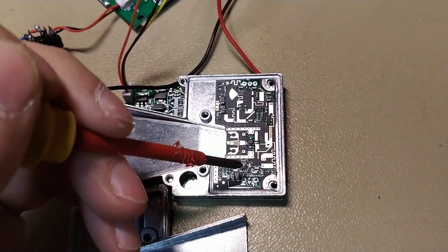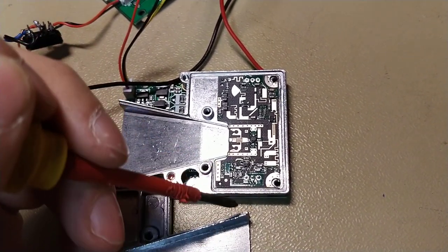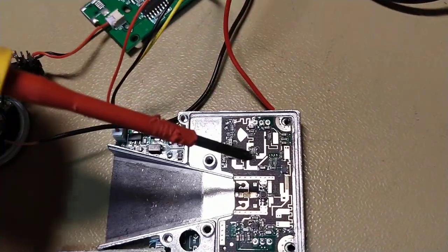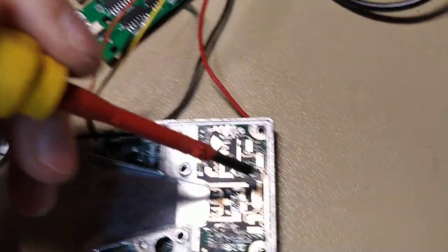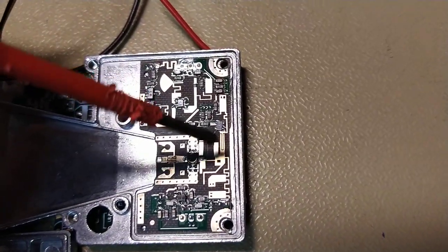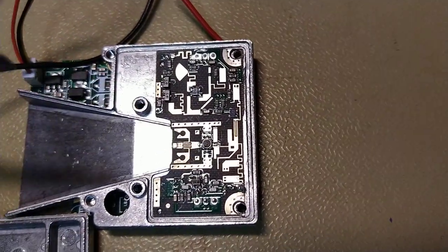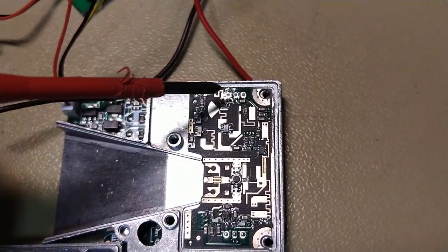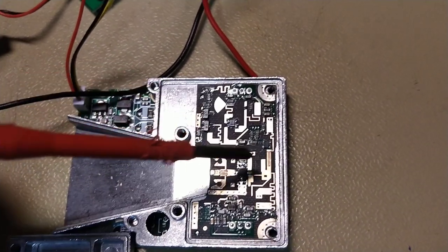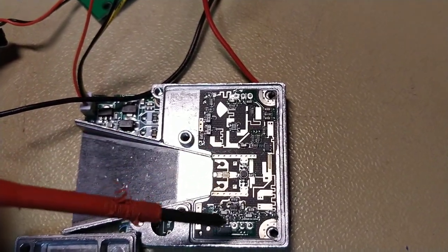And it has a BFP405 transistor used as an intermediate frequency amplifier, which pushes it to the logic board beneath it. On the local oscillator side, we have the oscillator transistor, two varactors, and a buffer amplifier, and a small bandpass filter feeding via some matching to the mixer. And that's about it. It sweeps the local oscillator thanks to the varactors here by pushing a voltage to those. The incoming RF is mixed down to the intermediate frequency around 1 GHz, and that goes to the logic board,